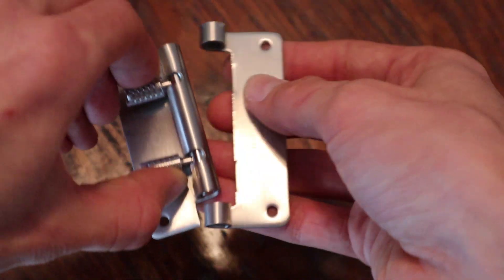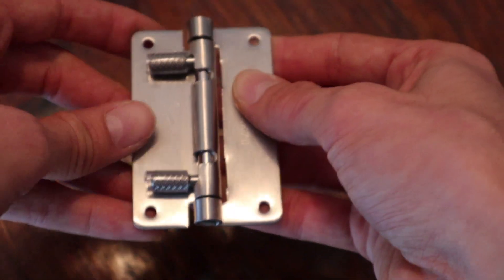One of the most impressive things about my friend's solar system was the way he mounted it to the luggage rack on the pop top. The panel is mounted by four stainless steel hinges that can easily be taken apart and put back together, so the panel can be removed from the car and put back on really easily. If you only take off one half of the solar panel's hinges, you can tilt the panel forward or backwards and point it more directly into the Sun, getting more power out of the panel. Alright, let's get everything hooked up and see how it works.